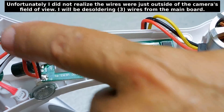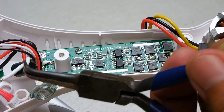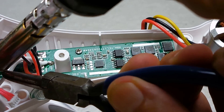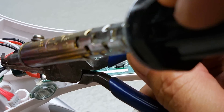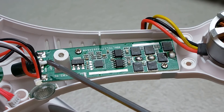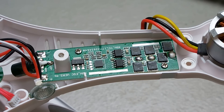Red and white go to the LED. The minus on the board is noted. This board only uses the black and white wire heading over to the control unit. The new board has a red wire — I'll just be disregarding that red wire as the new board is slightly different but does the same thing.